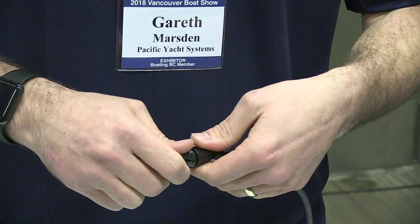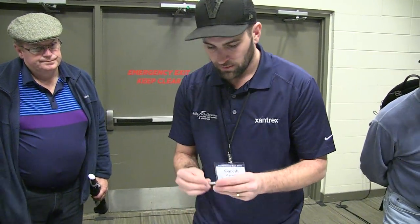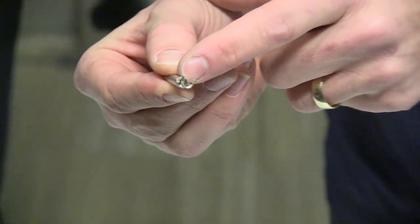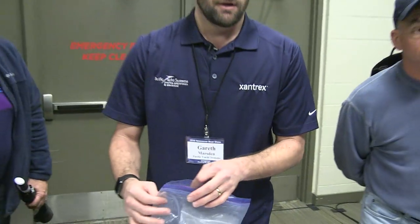And you said you could tug at that point and make sure. Yeah, so now I won't be able to pull that out. On these pins, you can see all those little jagged bits there. That's what clicks in and prevents it from being pulled out again. So if you have second thoughts or you haven't quite got it right, your disconnector is gone. You can cut the pin out and basically start again with a new pin connector and put it back in.